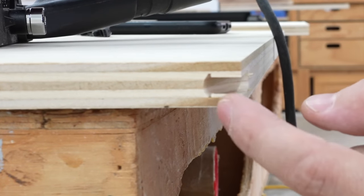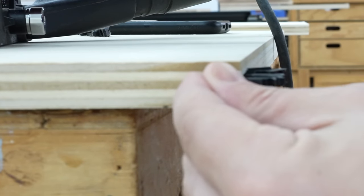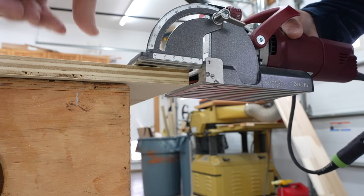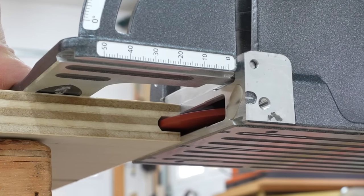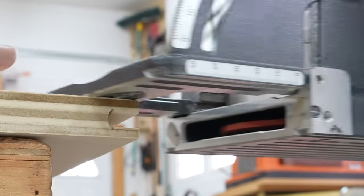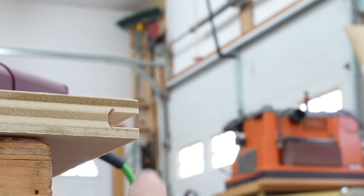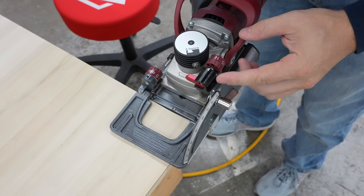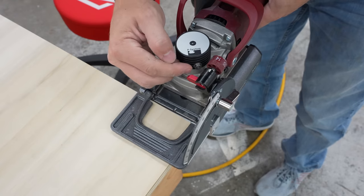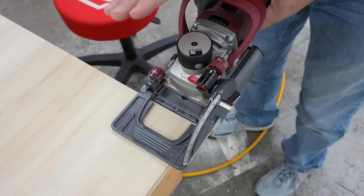So you see there that groove and how that allows these connectors to slide in like so. Here again, watch the plunge as we get all the way to the end. It happens very fast - all you hear is a click and that blade jumps in there and it creates that very unique little channel. Watch this point as I get to the end of the mortise - you'll see that this piece bumps up against this piece here, and that is what engages that oscillating function.